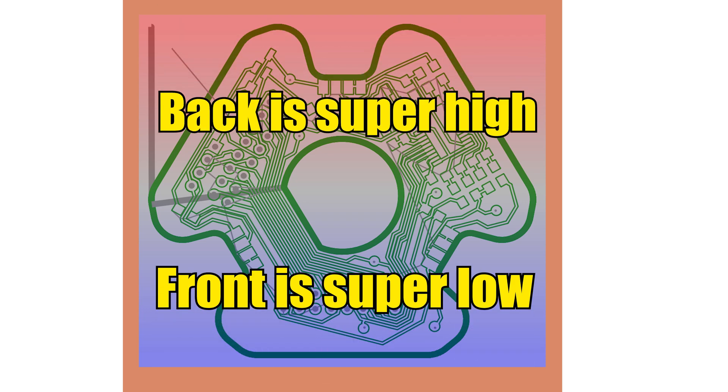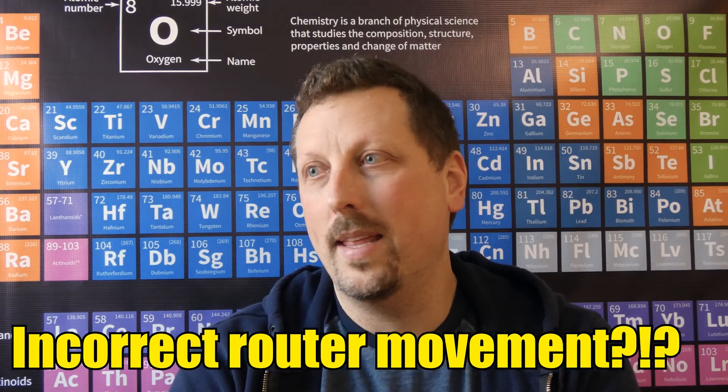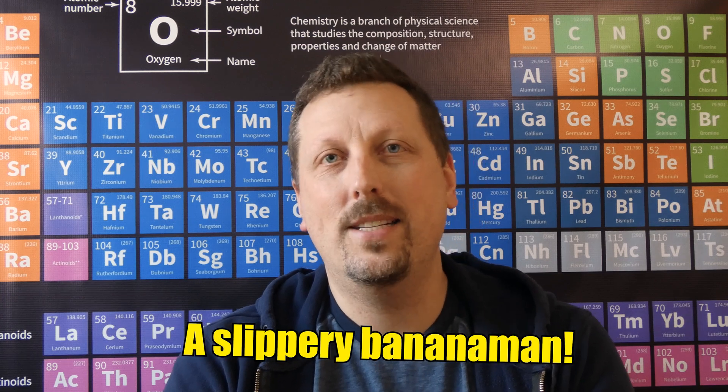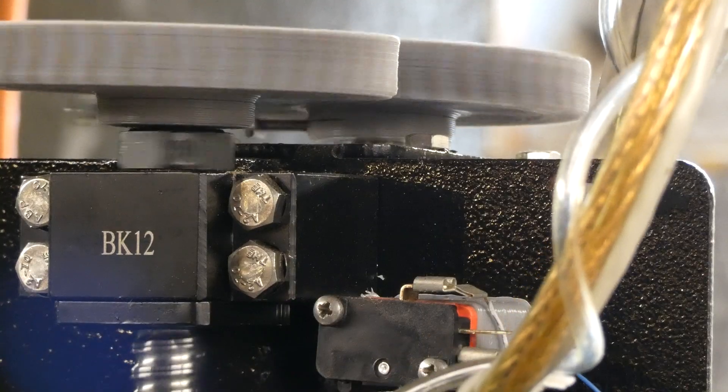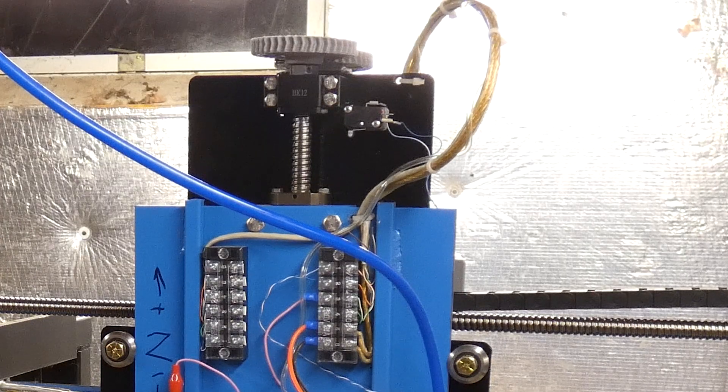Like, what happened? Eventually I noticed that the probe height map was showing a pretty heavy slant — higher in the back and lower in the front. And then out of the corner of my eye, I saw it moving in a way it shouldn't have. I started jogging the Z-axis up and down, and it's like a slippery banana — just not doing what it's supposed to do at all. The set screw was loose on the gear on the Z-axis motor.